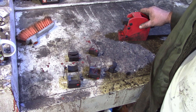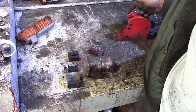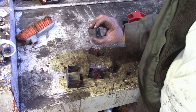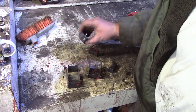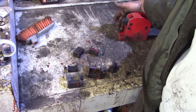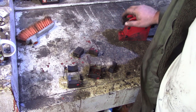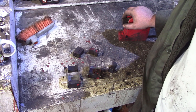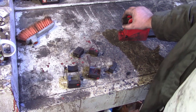It's incredibly heavy. So there are smaller ones you can get. I wouldn't. This only gives you sort of an inch throat, and if you want to make a flange that's bigger than that, you'll end up doing a lot of hammering, like I did when I was making that shroud. And a smaller one's only going to let you make like a half inch flange on the edges of your curves. So big as you can really is my advice, unless you've got particular requirements.